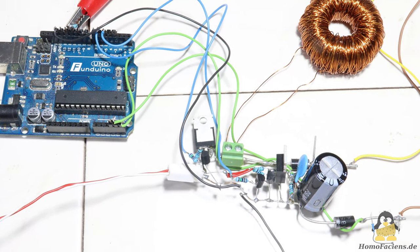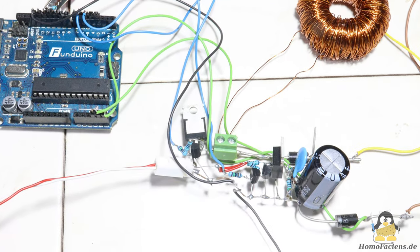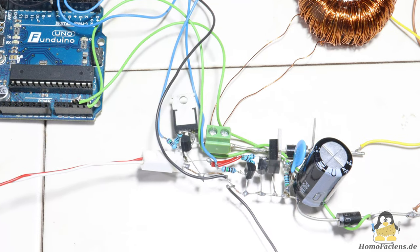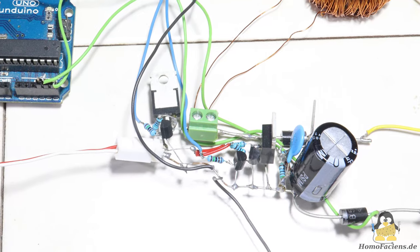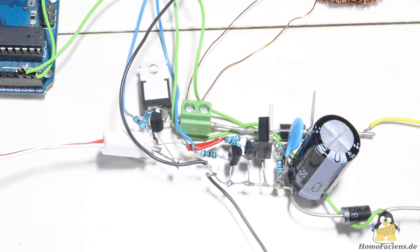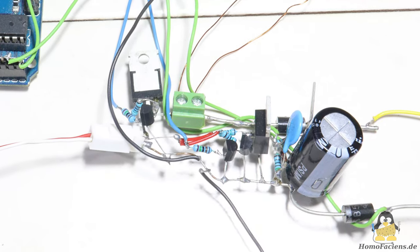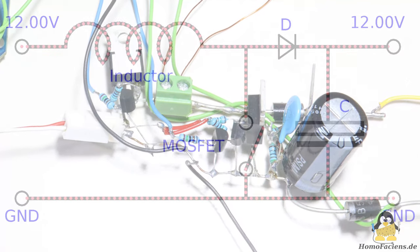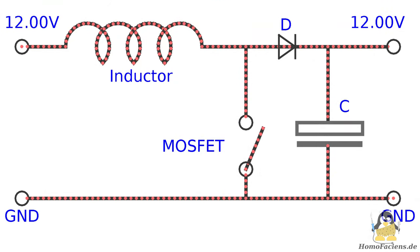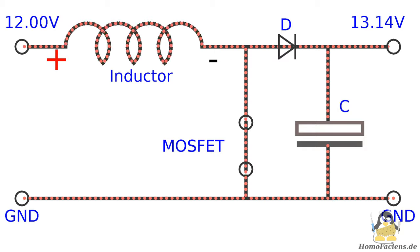In this EDM video I want to take a closer look at the electronics and address key points for future improvements. As shown in the first video, the circuit is the rustic version of a boost converter with the components joined via copper wires. The circuit is fed by the 12V line of an old computer power supply and an output voltage of up to 40V is generated by the main components.